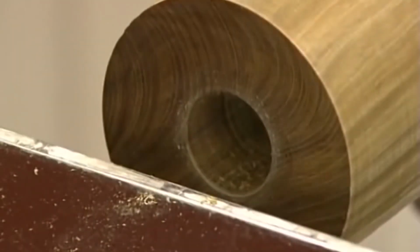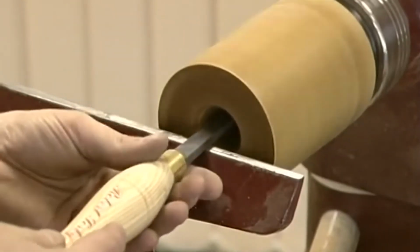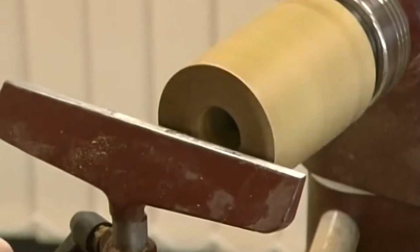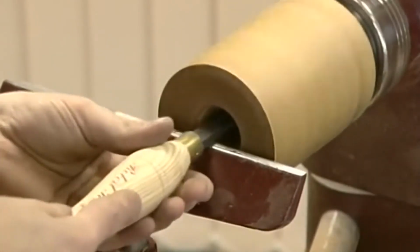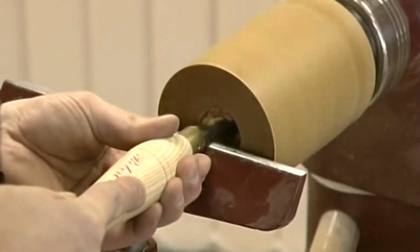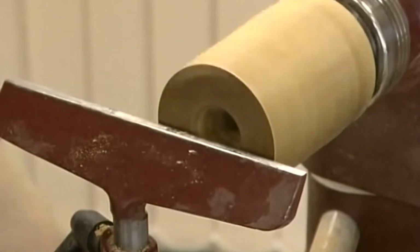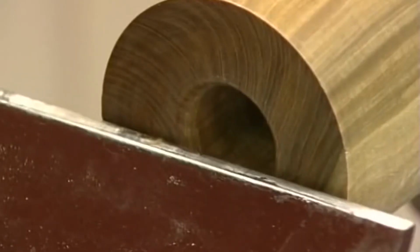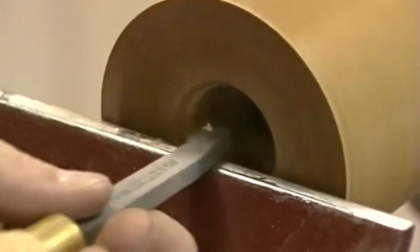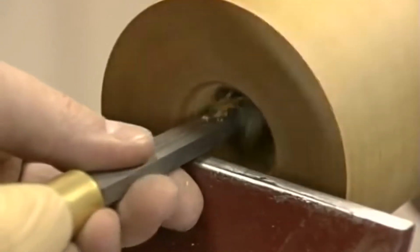Continue hollowing until you have reached the required depth. Ensure the walls are parallel and cut the recess with the relief cutting tool. At this depth, you will see the tool is almost at its operating limit. We can now cut the thread. The circular motion remains the same, irrespective of the depth of hole.